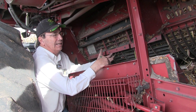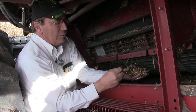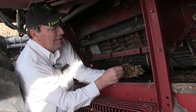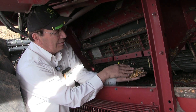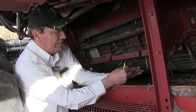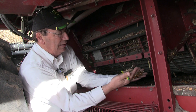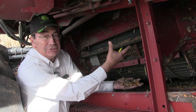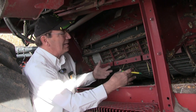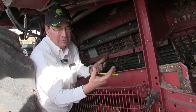You can also take a quick look down into the auger bed. I'm going to grab a handful of it here — this is the combination of all the threshed materials, so the MOG (material other than grain) is in here along with the shelled corn. The kernels are not cracked, not chipped, there are no stress cracks in them, so I think we're doing fine. Poking around and looking at the cobs gives you an idea of how fast we're getting the kernels shelled off the cob.